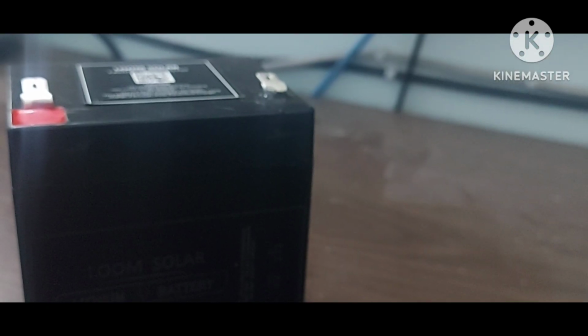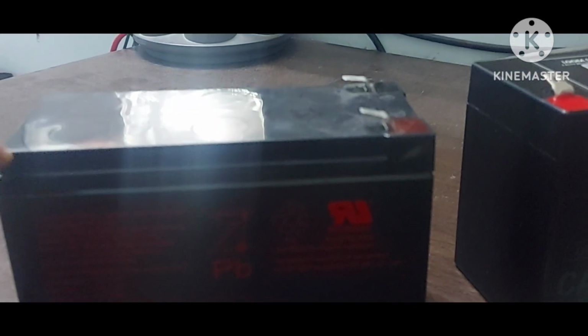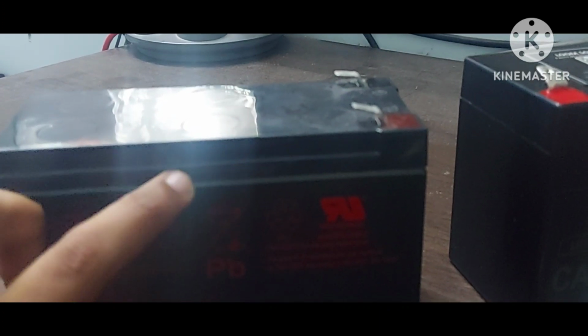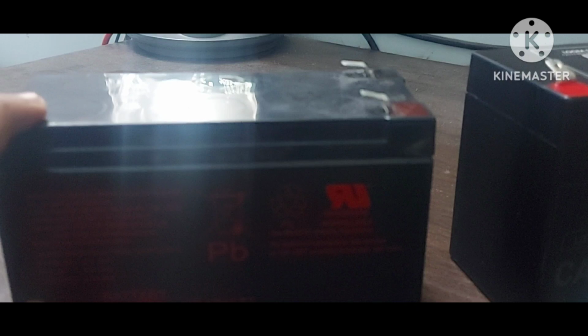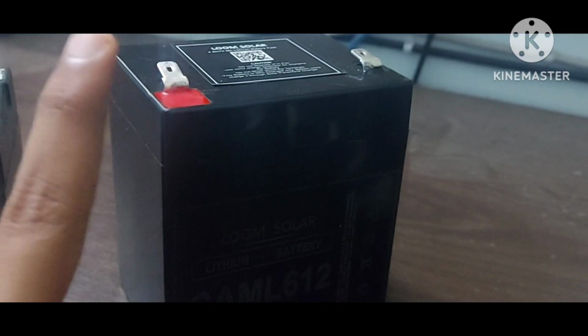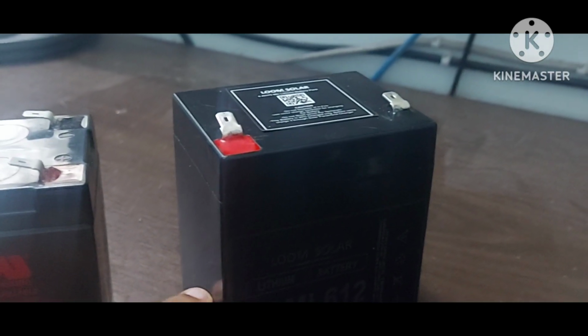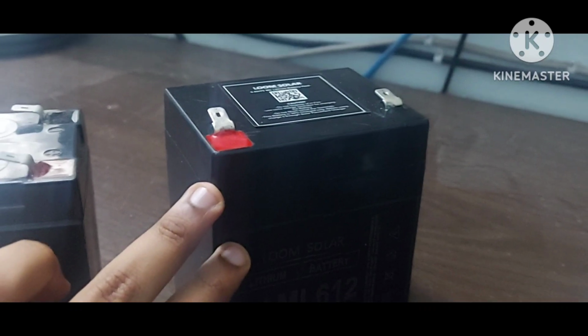Okay, another point to be added is that for us electrical enthusiasts, lithium ferrous phosphates make for a very good benchtop battery. Normally, the majority of us will have one of these batteries on our workbench to quickly test circuits, quickly test devices, and to use as a source of power for some portable applications. Lithium ferrous phosphate can do all those jobs very easily without a problem. So they are an ideal benchtop battery. They are a good replacement for lead acid as a benchtop battery, and they can definitely do some good jobs.